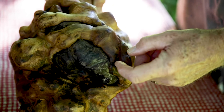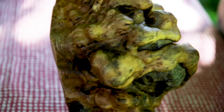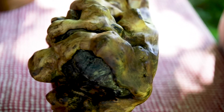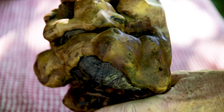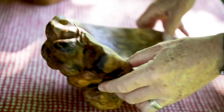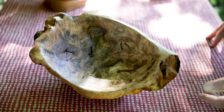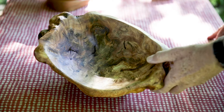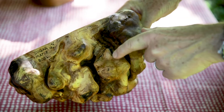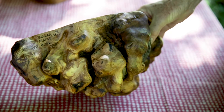This is a smaller maple burl and you can see there was actually an old burl that had died and started to rot — that's the dark stained wood — and then fresh wood began to grow around it. I couldn't figure out any way to improve on that as a design, so I just sanded and polished it. With all these bumps the bowl will sit — it's pretty easy to find three legs for it to stand on. When I carved down in, you can see water had penetrated through all the different cracks, so there's spalting which causes the darker browns and black colors and really highlights the grain in this piece of sugar maple.